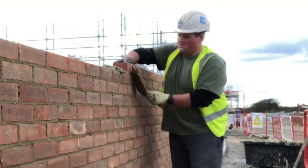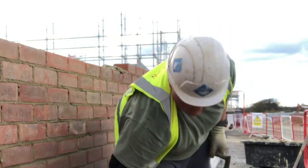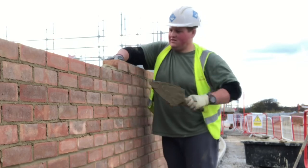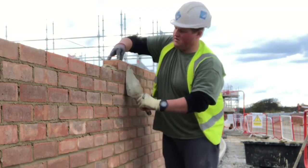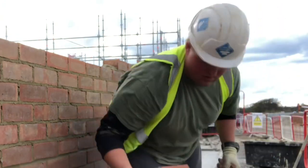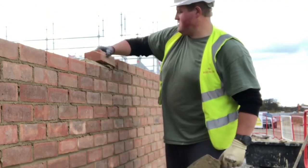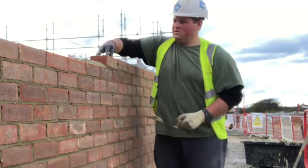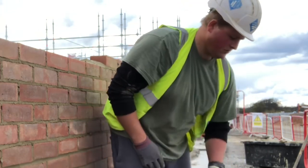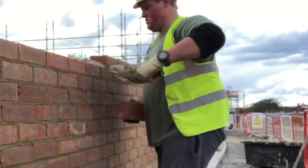Also, the brick makes a big difference to the way you do the pick and dip. With perforated bricks you're going to use more mortar than with a frog brick. Your mortar consistency can more or less be what you'd use for traditional, but you're going to want to use a long spread variant first if your mortar is wetter. And as it stiffens up through the day, especially in the summertime, you can then convert to a one trowel per brick pick and dip style.